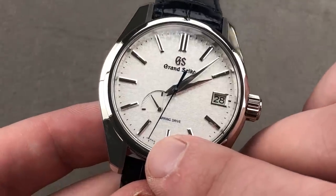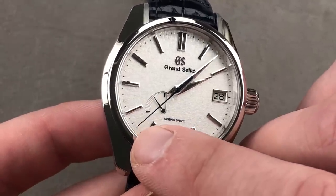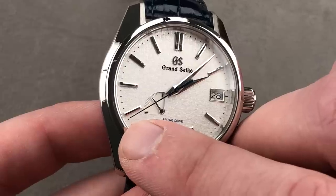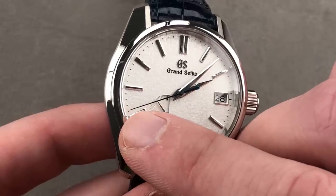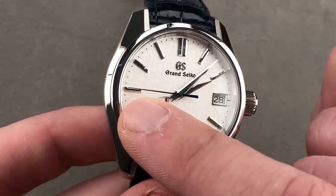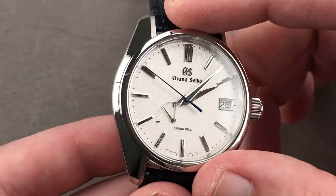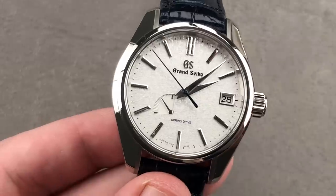Because it's a unidirectional governing wheel, the seconds hand sweeps continuously. There are other hands — for example the Bulova Precisionist — that appear to sweep, but even that stops and starts. This is the only clean sweep. Piaget has tried to emulate this technology with some degree of success, but we're talking a few dozen watches. Grand Seiko has mastered this technology.